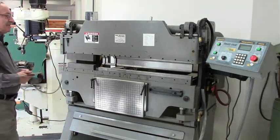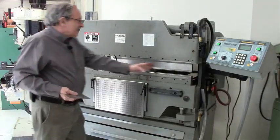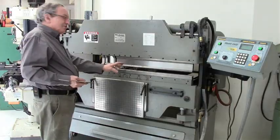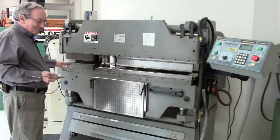The next machine is a brake, or the press brake. This side is set up for regular bends. This side is all kinds of custom bends and custom tooling. And this side is just flattening dies — in other words, that's the undo button for wrong bends.